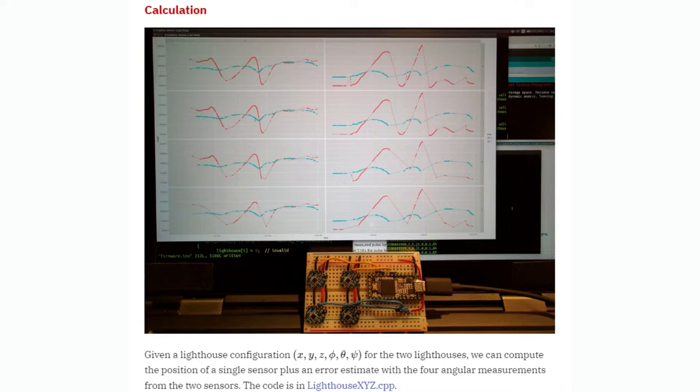He's got the TS4231. You get the pulse and envelope data and can see it graphed out. Using matrix math — documented in a couple of libraries if you don't want to figure it out yourself — you can get within a couple millimeters precision for X, Y coordinates using only two lighthouses, though you can have up to four. You then communicate your X, Y, Z position to a base station. This is a lot cheaper than ultra-wideband, since infrared light is cheaper than four radio transmitters doing time-of-flight. Time-of-pulse distance is also easier than time-of-flight.